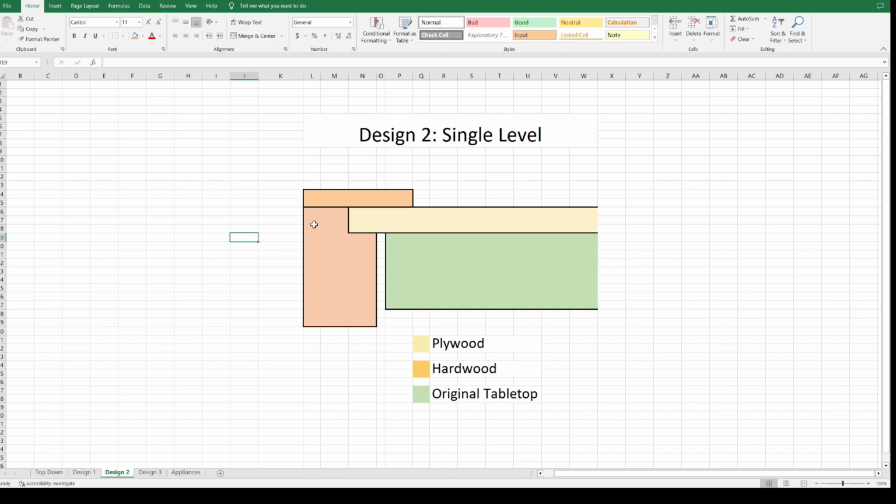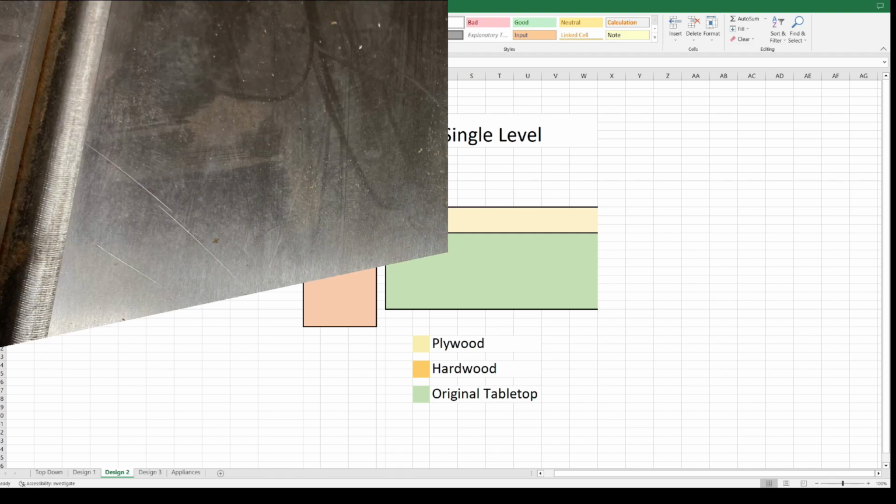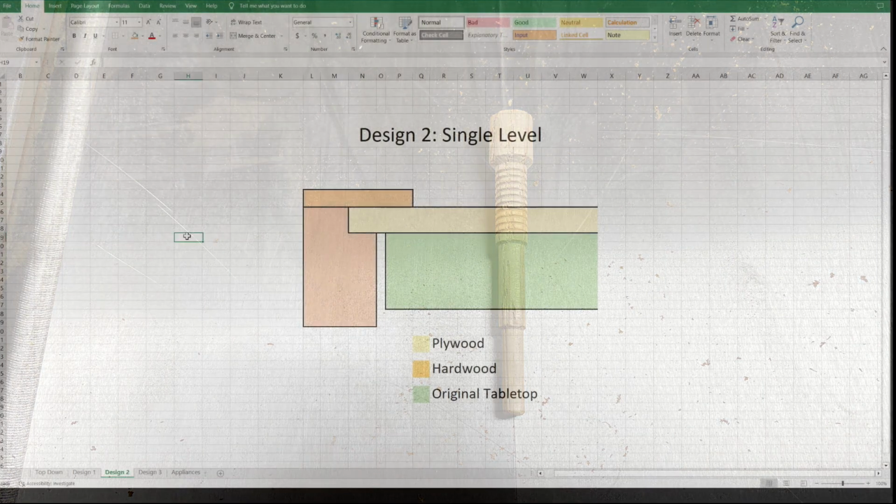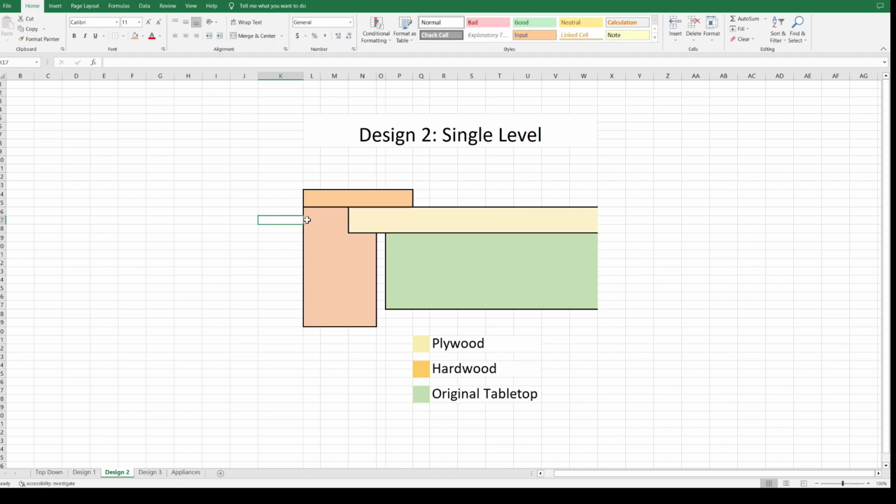There's also things you can use to actually really attach this firmly, something called a Miller dowel, which I have used before, I really like. It's basically a cross between a wedding cake and a golf tee. If you think of it that way, it'll make sense. I'll show you one. And it has a special drill bit, and it would drill right through and into that table. And then you could cut it off flush with the side of the table. They look very nice. They're made out of good hardwoods, and they would blend in very nicely, even as a decorative thing, even though it would be functional as well.